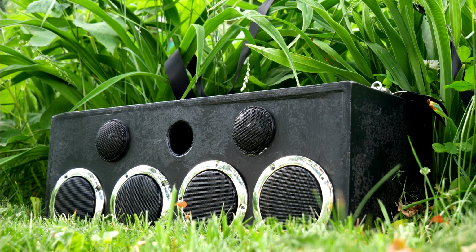My port is around 70 Hz because I want some of that boom. You can, for example, make a closed box that can be musical. There are a lot of possibilities. The big plus is lithium 18650 elements, because you can easily replace them when you need to and you can use the speaker for days. One minus could be the visual look, because I'm pretty bad at carpentry. I think I'll just cover it with cloth and it will be okay.